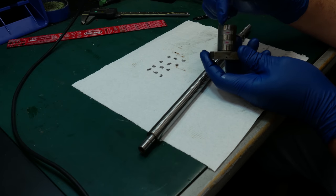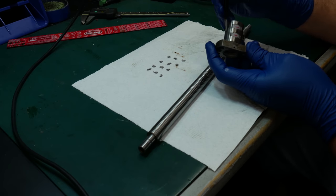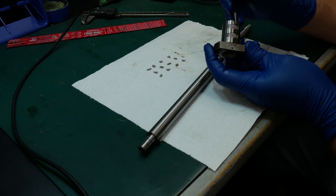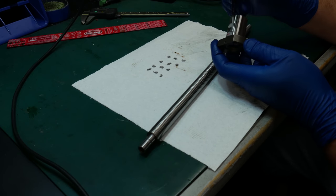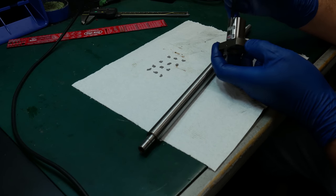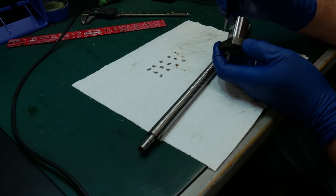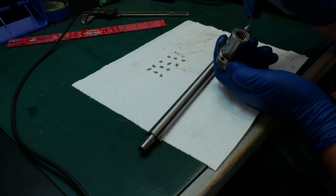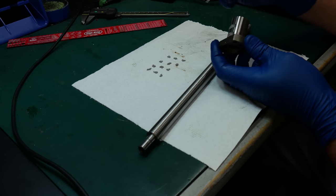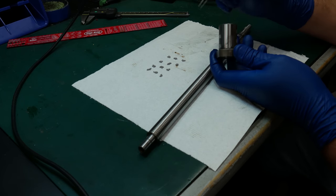on the underside of this plastic bit here, it looks like it's nylon probably, as the ball comes around the backside and comes up over here to this part, this thing shoots it back over here to restart in the same thread again. And there's actually four of them. So each circuit of balls around the ball screw only occupies a single thread. So there's lots of threads in there, but we're only using basically four paths.